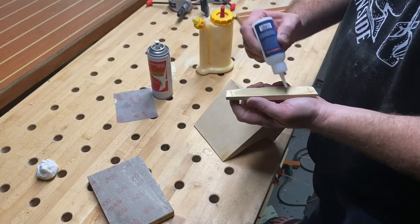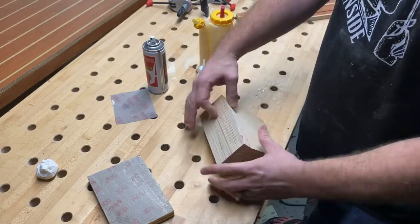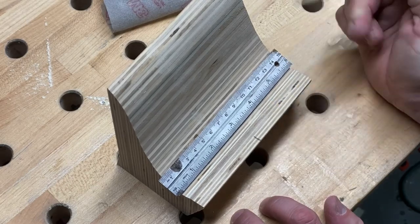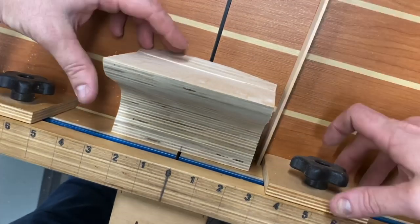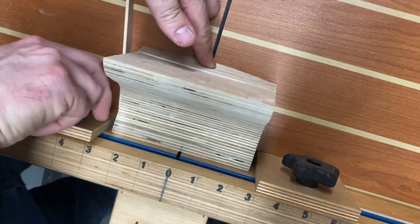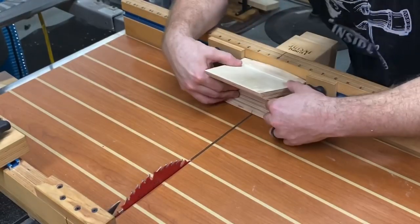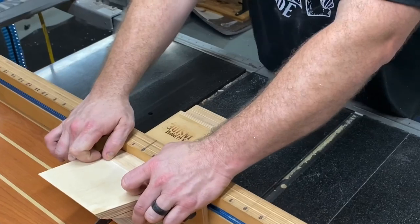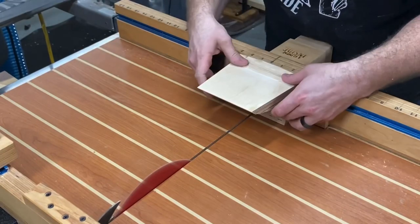The piece that was cut off from trimming the front to expose the edges, I'm using on the back. It creates a little bit better visual interest, and all edges are visible on all sides of the piece — that was the look I was going for. With the blade back to 90, we're going to bust out the cross cut sled one more time. This time I'm going to use its stop blocks as a method to make a dado cut that's going to receive the cord and keep it up charging the phone. Using a multiple stop block system where the piece can go back and forth, I raise the saw blade up to about one inch, make a pass, move the piece over slightly, make another pass, then butt it up against the last block — and now I have the groove I was looking for.